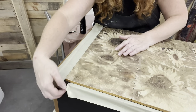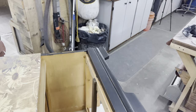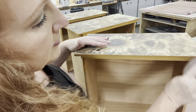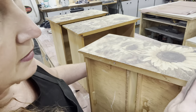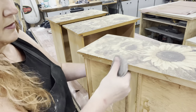I added tape on it to protect my paint job from getting any polycrylic accidentally on it. Now I've removed the drawers so I can go back in and get that excess that was cut off in between — just doing a downward sanding motion, making sure that it's just a nice crisp line blended in with the drawer front.